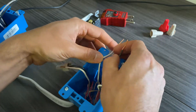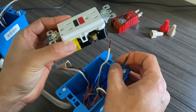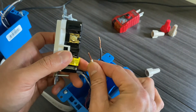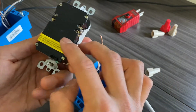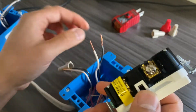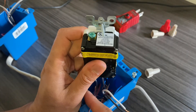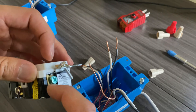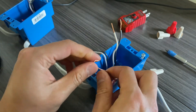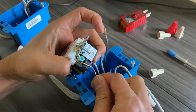Connect the identified line pair to the line side of the GFCI outlet. Please do not use a drill to tighten these screws. Make sure you strip just enough of the wire. You have brass screws for the hot terminal, silver screws for the neutral white wire, and down here is the ground wire. Start with the ground — insert it under the washer, or make a loop and go over the top of the washer, which is preferred so it doesn't slide out.